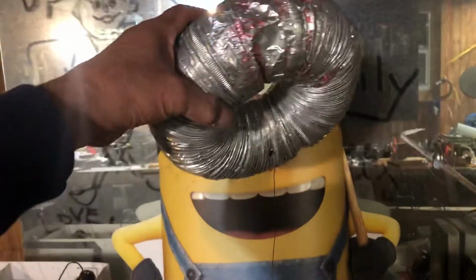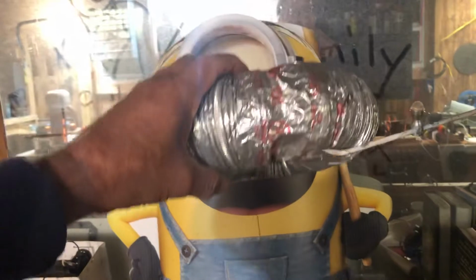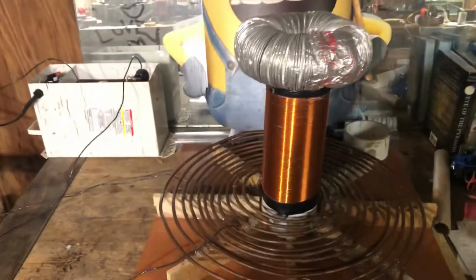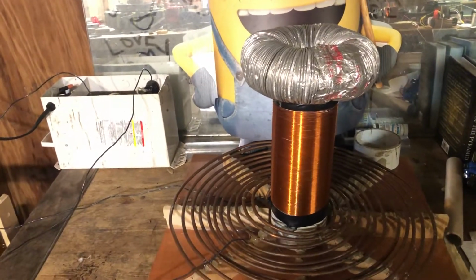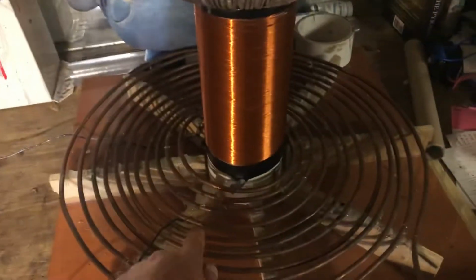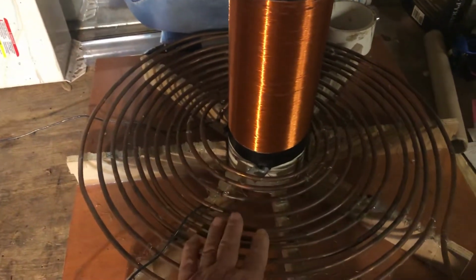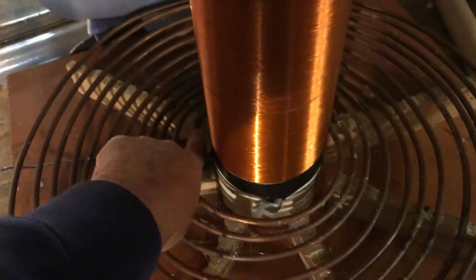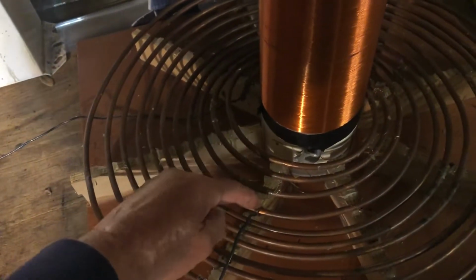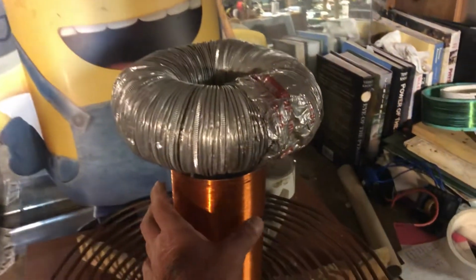Now, let's go ahead and put a little capacitance on the top. Of course, when you put capacitance on the top, you're unbalancing the system. So in this part of the system, the relationship is about timing. The connection of the other half is here, so you're looking at 1, 2, 3, 4 turns out. And that was to find resonance in the coil itself.